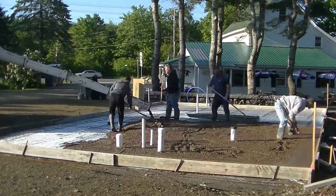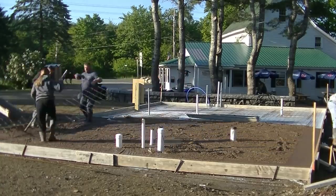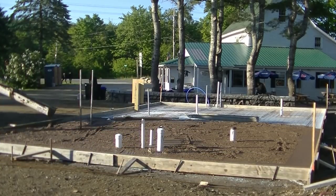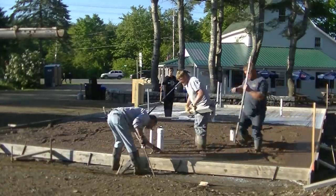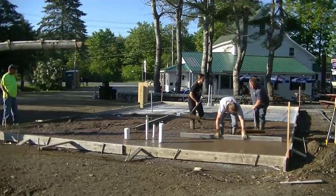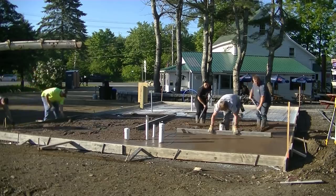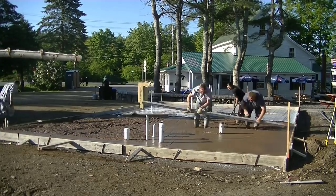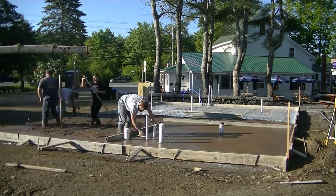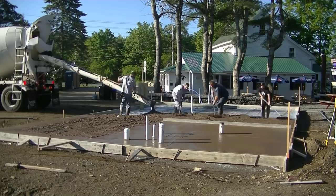Right now we're just getting this poured. We put the integral color in the concrete — it comes out a really cool looking color. We've done stamp barn board in all kinds of different colors. Probably the two most popular are this brown and the gold gray we use from Butterfield Colors. Brown and gray with that charcoal release both look really, really good when you're using the barn board. We personally really like the barn board stamp. Out of all the stamps that we do, it has a really cool texture to it. The grain and the knots look almost real — we're trying to make concrete look like wood here. We get it as close as we possibly can, but real wood is real wood, concrete's concrete. So let me know in the comments what you think — if it really does look like barn board when we get done here.